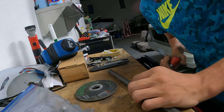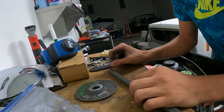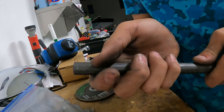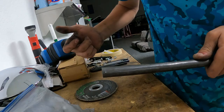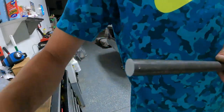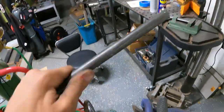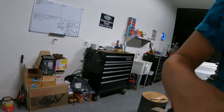The reason why people use a punch is to make a small indent into the steel so a drill bit can nicely go through and guide itself. On this round surface, if I didn't have a punch, the drill bit could roll off of the steel.